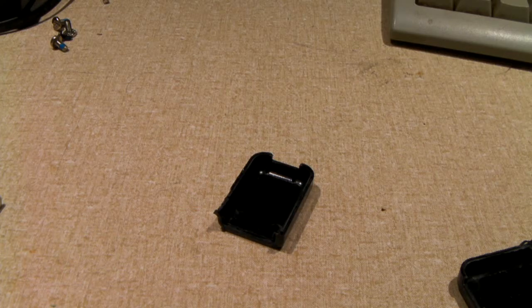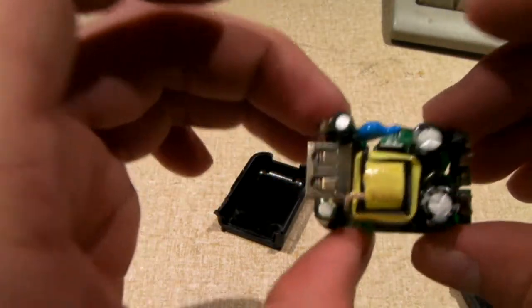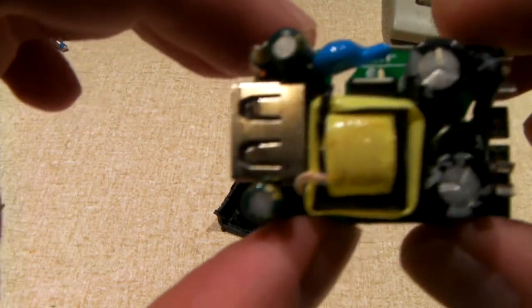Well, actually, not exactly. I think the capacitors on this one are a different brand. But I think the overall design is exactly the same. Just make sure these primaries are discharged, which they should be in something like this. Generally decent quality supplies, and even most cheap end units have bleeder resistors for the primary caps. So that's a look at this one.